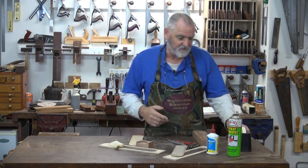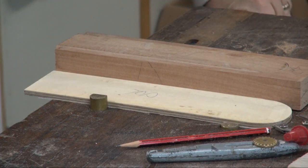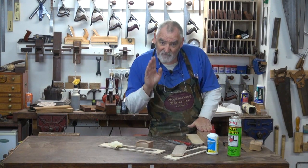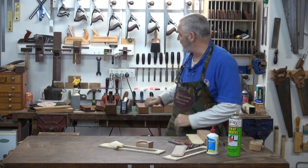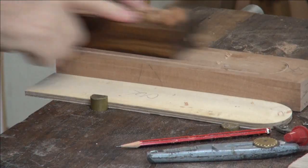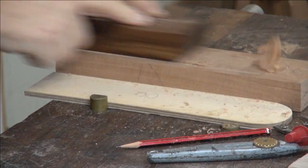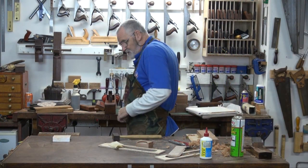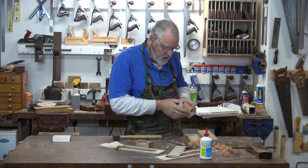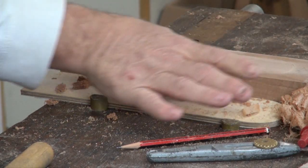Depending on your confidence level or skill level, there are a couple of ways you can do it. You can pop it in a vice and just sand it, but there's a lot of sanding to do. Or if you're reasonably confident and you've got a nice sharp plane, you can plane it down. But be careful not to touch these edges here — we just want the top done. It doesn't matter if you use a block plane or a smoothing plane, just a very, very fine cut. Now I'm happy with that. I'll just get a little bit of 220 and a sanding block and just lightly go over it so I can mould the top into the side.